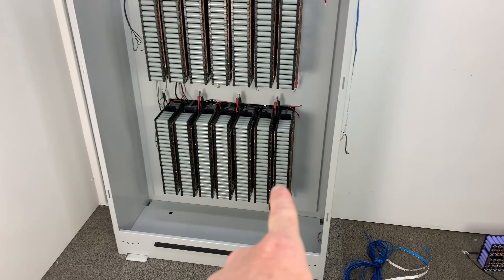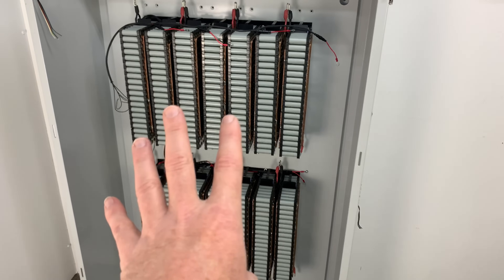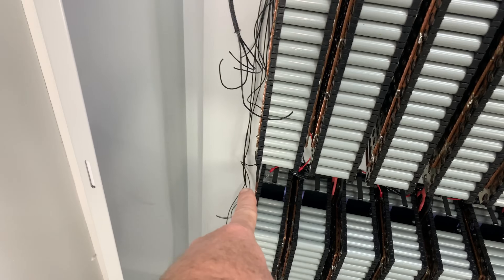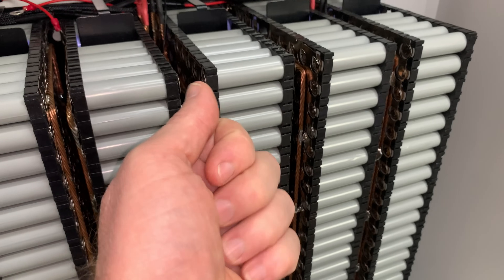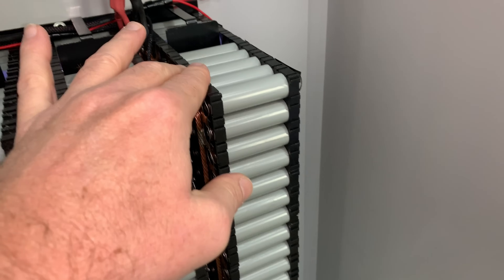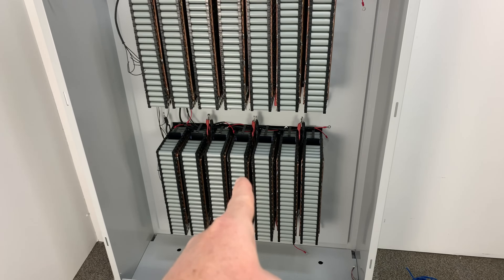So I've got about 10 metres of 35 millimetre fine strand welding cable. The plan was this was 24 volt — it's now going to be 48 volt. So that means I've got the negative terminal here, and ideally I'd like to have the positive terminal down here. But I've got another negative because I put the negative on this side and the positive on this side for the entire battery. So I'm going to have to grab this bottom battery, pull it all out, pull all the nickel strip off — which is going to hurt my soul — and turn the batteries around and reconfigure them so I've got the positive on this side and the negative on this side. Then I'll be able to place a cable from here down to there, which will make the battery layout and cable management a lot neater. So let's get after a 12-hour time-lapse and get that bottom battery reconfigured.